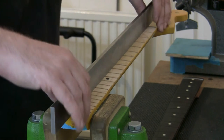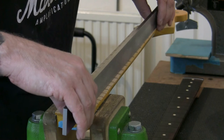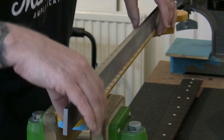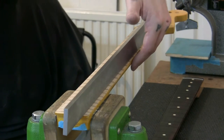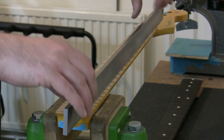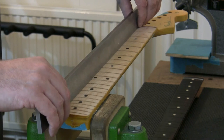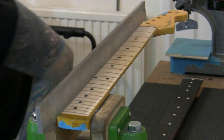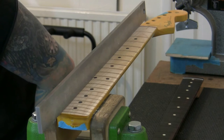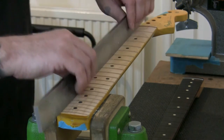That is just beautiful. This is all about getting precision tools, building the right jigs. I do build my own tools. That's the second neck jig I've built. One for sanding fingerboards on removable necks, and then one for levelling a fingerboard on a set neck or glued in neck. And this, my friends, is fantastic. You could not get that straighter by hand sanding. Really, really pleased with how that's gone.